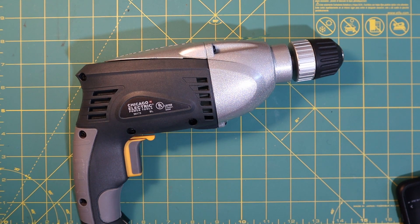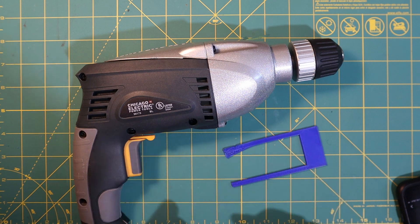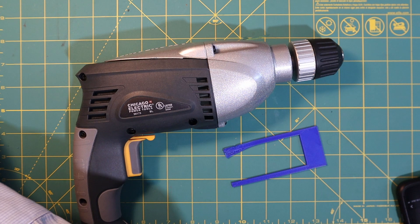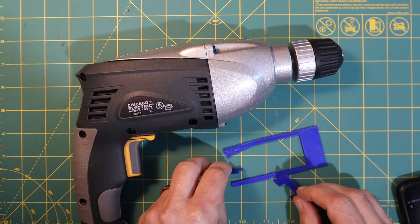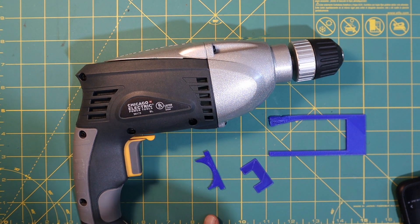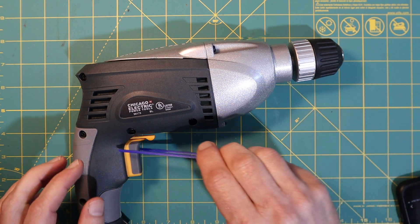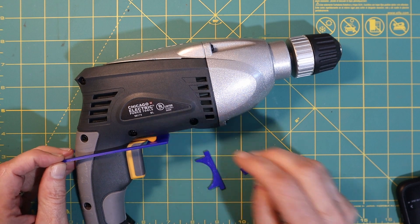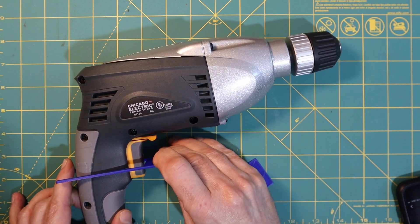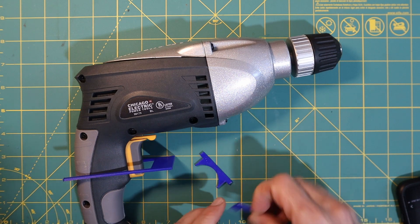On the computer I came up with the initial design and printed out a few pieces. I used the trick of printing at a fairly thin layer height so that I can test it out and see if it fits, and I can put this on here and put it down near the bottom and you can see that fits in there.